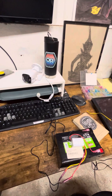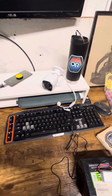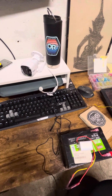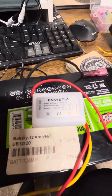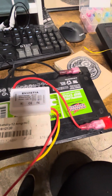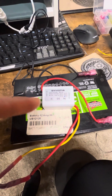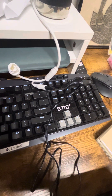It's just a fun project. The camera runs on nine volts, so we need to get from 12 volts down to nine volts — simply invest in a step-down converter. The input runs off the 12 volt battery leads and the output comes out at nine volts. I just took a nine volt USB cable that I had — it fits perfectly, you can buy these on Amazon.